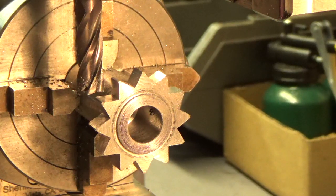It's been 15 minutes since I shut the camera off last time. We're down a hundred and thirty some thousandths, so theoretically we're a little bit shy of the point. We could probably go down another ten or twenty thousandths with no problem, but I'm going to leave the point a little blunt. I think I'm going to end it right there and call it quits. We're going to now take the star wheel off the rotary table, leave it right in that chuck, put it back on the lathe and cut it off, and we'll have another star wheel.